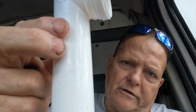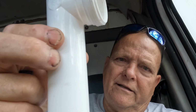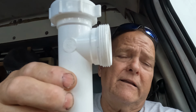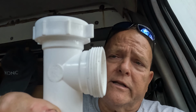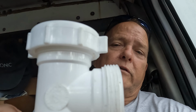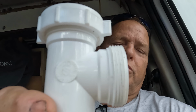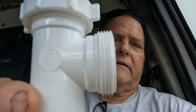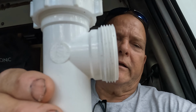And this is tubular. It's very susceptible to warpage and sagging. If you dump a pot of hot water in there, these joints, there are so many mechanical joints under a sink when you use these cheap pieces. If it falls, even if you plunge it, sometimes it'll push the 90 right off the tailpiece. So that's why I don't use these.